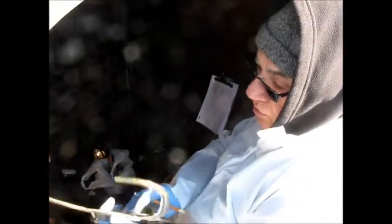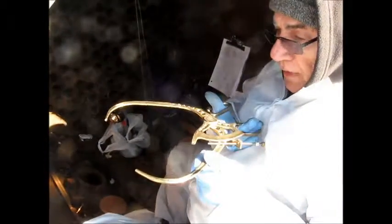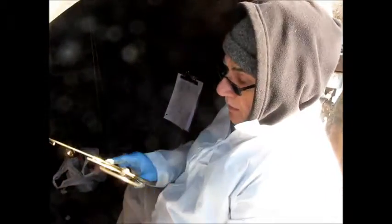Inside there I'm going to be taking off dimensions. As I showed you, this is a caliper that I made — one of the tools that I made as an apprentice pattern maker. What it helps you do is take dimensions. This is adjustable; you can take dimensions inside of a casting, then open it up, take it out, and close it back up, and then actually measure what your dimension is. Which is very useful for what I'm going to be doing.